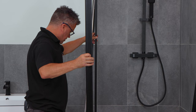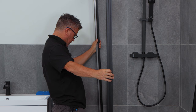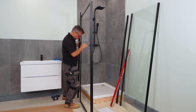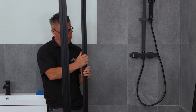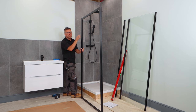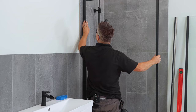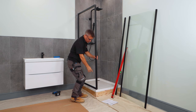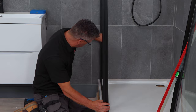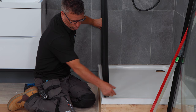This is the main frame that will be attached to the wall via this channel. There is a tolerance of about 30mm, which allows for any discrepancy with your wall tiles. You can see it's butted up against there with a little gap down this end, and that 30mm on the bottom of this corner allows it to come in and out a fraction. What you want to do is try to have an equal overhang on this shower tray all the way around so it looks symmetric on both sides.